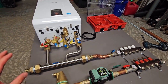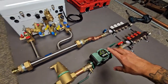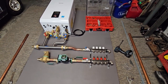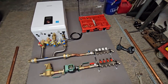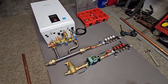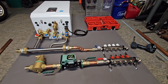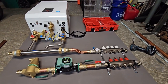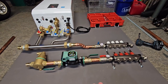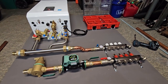To go over this one a bit more: it's a single-zone combi system feeding the four loops for the in-floor heat. I'm kind of just laying it out right now. I also take into account how the customer wants things set up — whether zones are on the right or the left, I can orient these into any configuration needed. There are different circulator sizes depending on how many zones or loops you have, and I spec all of that out for you.